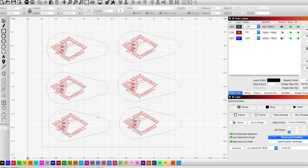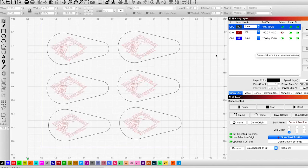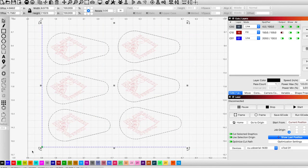It's important to note that I used the same file for the bottle opener to get this outline. The X-Tool D1 has a very fine beam and didn't require me to scale the design to compensate for the kerf. In Lightburn, each color represents a different operation. To make our template, we're going to leave the black and blue operations enabled and disable the red operation by turning off the output. I'm selecting all of the elements of the design so the machine always starts from this corner. I have the job origin set to the lower left corner and start from current position selected. The machine should always return to this start location, but in case I bump the laser or want to use this template down the road, I can just move the crosshairs back to this point. A proper jig should always have a reference for your start location.